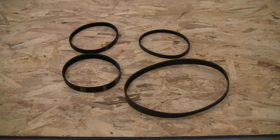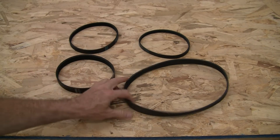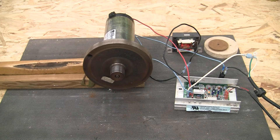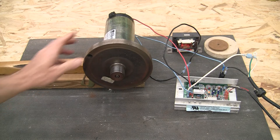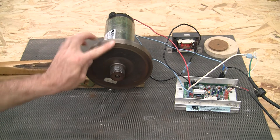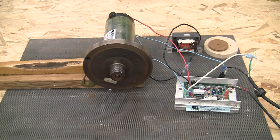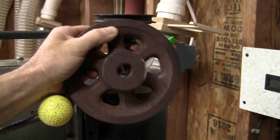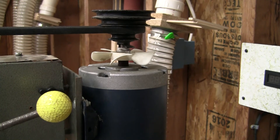Before making any irreversible changes to my existing pulley I needed to see if I could get a longer micro V belt — and no, that wasn't happening. The longest treadmill belt I had was about half the length I needed. Now up to this point I hadn't taken the motor I was planning to use down off the shelf — it's big, heavy and awkward. I had another treadmill motor on my bench and like all treadmill motors I've seen, it has a one-piece flywheel and drive pulley. I'd always assumed I'd have to use the flywheel and pulley that came on the motor, but when I finally got the big motor off the shelf, hidden behind the flywheel was a fan — and another one on the other end. So it dawned on me that I could remove the flywheel and just use a regular V belt pulley.